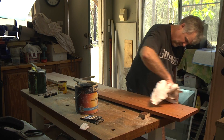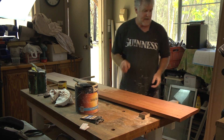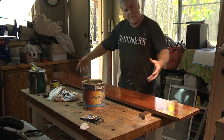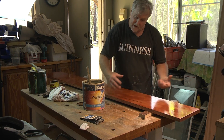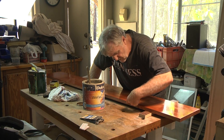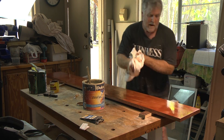Now that's nice and consistent all the way through. We're going to turn it over. I've turned it over and I've put stain on this edge. Two things at least you want to be careful of: because I've already done the other side and wiped it, and I've put fresh stain on here, you're going to have to watch the edges. You're going to have to wipe the edges again because of that little bit going over the edges. So you'd wipe that again.